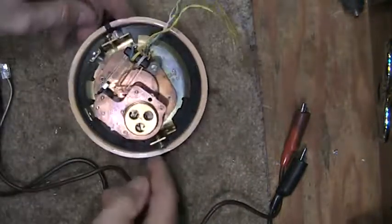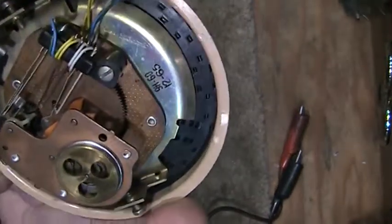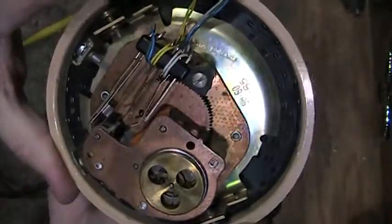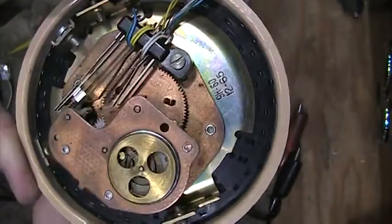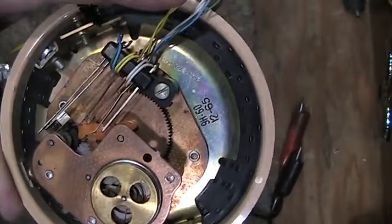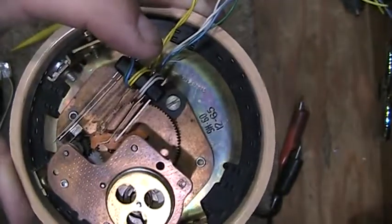I have a different dial without a cover. As you can see in the contacts, this has got 6 wires. This is just another shorting contact for a speaker phone. As the dial is rotated here, I will operate it 10 times and you will notice that this set of contacts will open and close. Right now they're closed. This is how you're signaling the number to the telephone company. The two white wires is a set of contacts that short when the dial goes off normal and remains shorted until the dial returns to its home position.